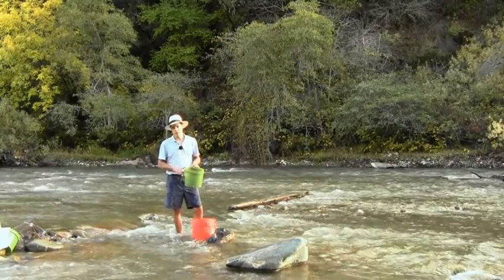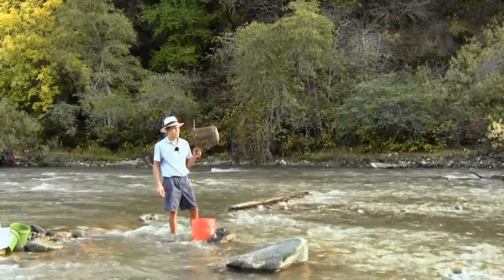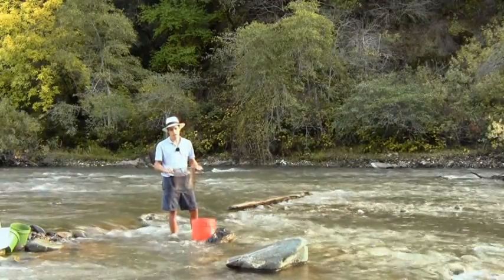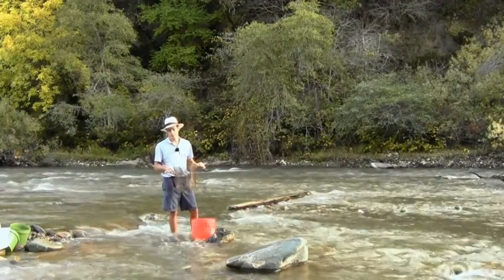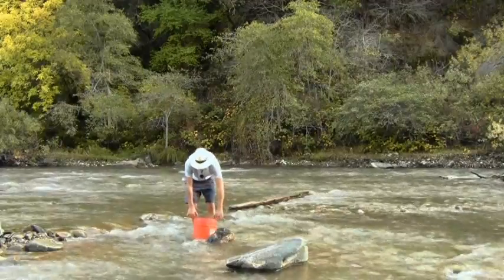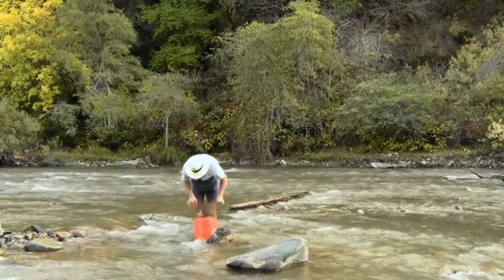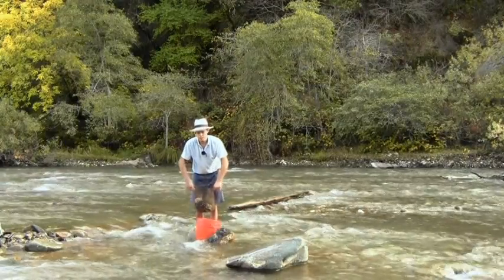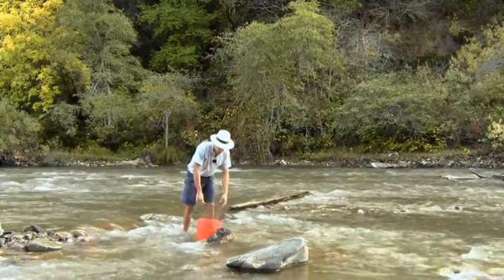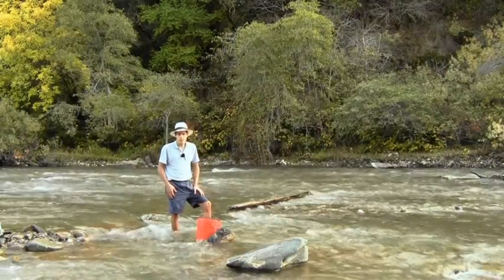But I was working a lot of dirt and wanted an even better way, so we built this thing. It's that same expanded metal mesh wrapped around in a circle, welded together with the bottom welded on, two bolt handles on the sides, and a bucket handle on top. This thing works awesome. You drop it in, fill it up with dirt, shake it around, push down and twist — and it's clean already. A lot less work and hassle. Some people call this process a grizzly, because they used to make big boxes on top of sluices called grizzlies, but really it's a classifying screen.